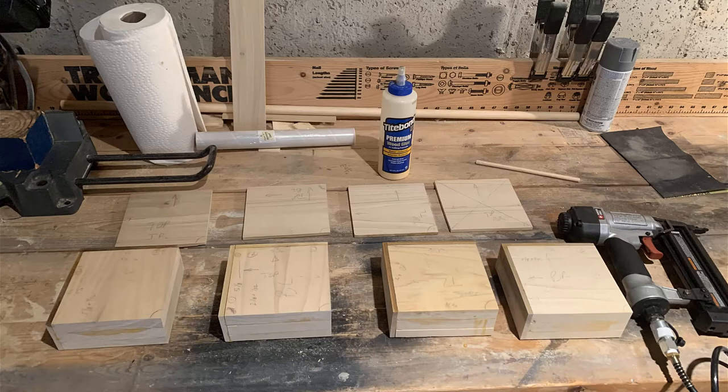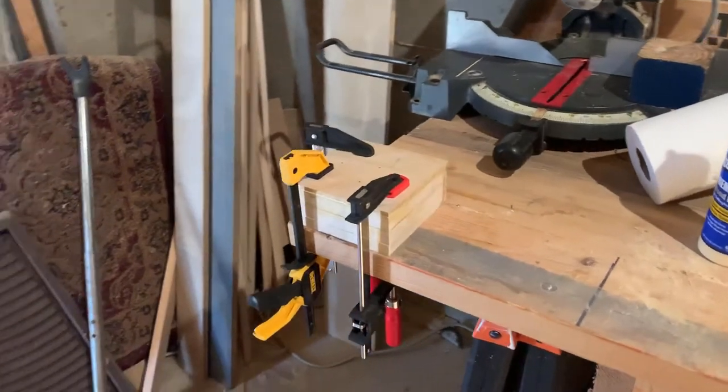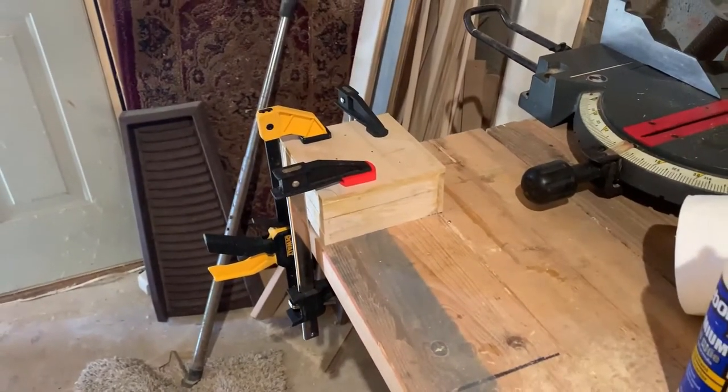I glued up the four blocks and also cut to size those finished pieces — maybe two on each side of each block — so that they would cover up all of the seams of the three pieces of wood stacked on top of each other. In the background you can see I cut finished tops for the block, because I wanted to hide the seams where the finish boards are seen from the top down. Now I'm actually gluing the top down on top of the cup holder block, doing two at a time because of my limited number of clamps.